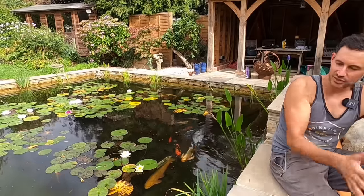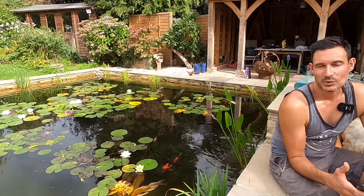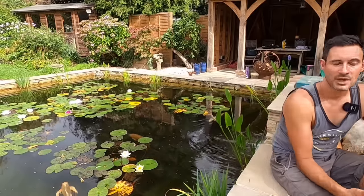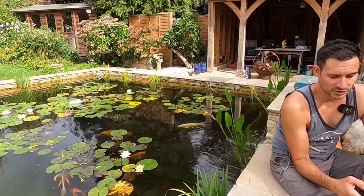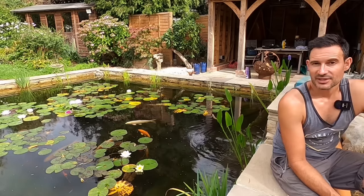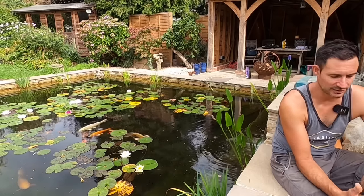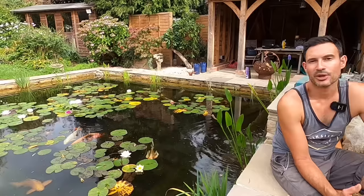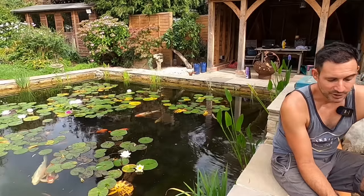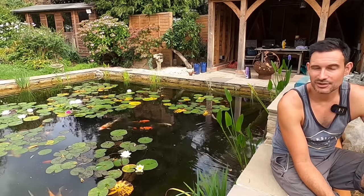Now, obviously you cut it into strips, there's gonna be slight overlaps. So I'm gonna want to have more than the 68 square meters to be able to make sure that I get a nice layer of fleece all over. So I'll double up, then I'll have twice that quantity. There's a lot, obviously, of stones and sharp bits and pieces which we're using to fill the voids. I will put some sand down and some softer soil down to cushion everything, but it will still be prudent to put a nice thick layer of pond fleece down to protect the pond liner as well. So we'll ring up the good people of Gordon Low, get some pond liner ordered, and hopefully that'll be with us towards the end of this week.